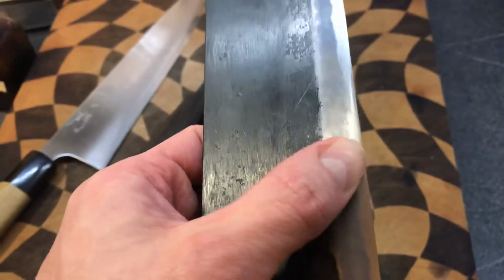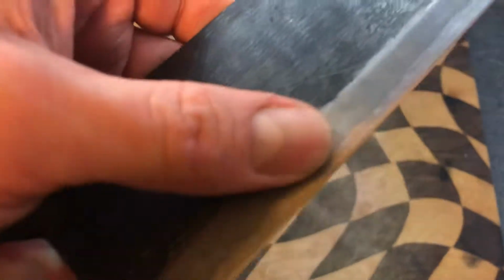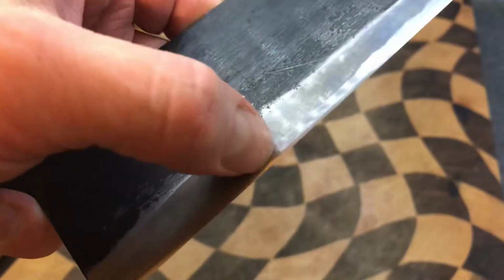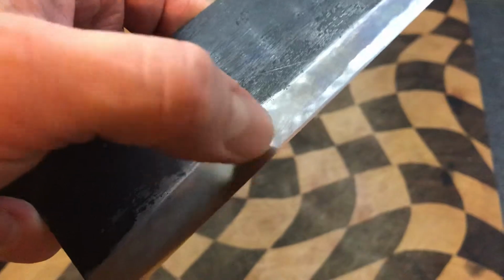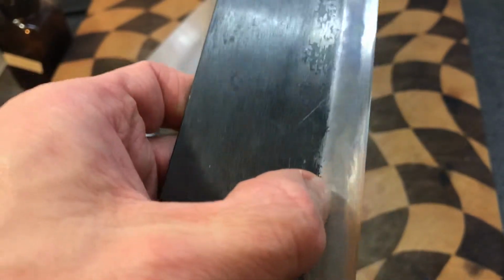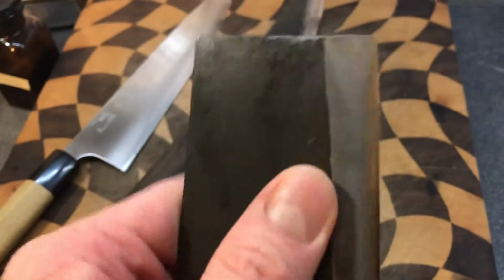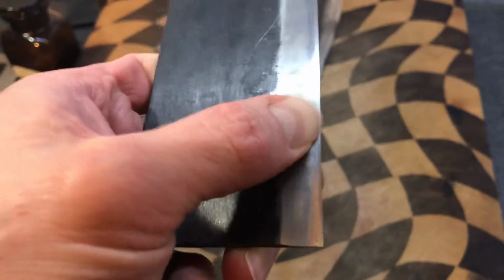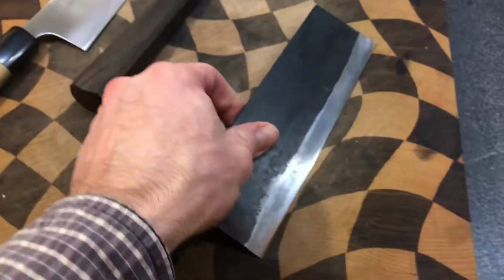And the wide bevel is actually ground slightly concave. You can still see scratch marks from the wheel going perpendicular to the edge, and the shiny parts are where the blade contacted stone when I was working on it a little. I'm not in a hurry to remove the concave part, it's very shallow, it doesn't really disturb in any particular way.